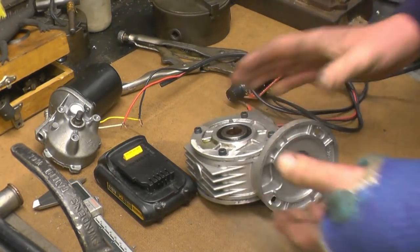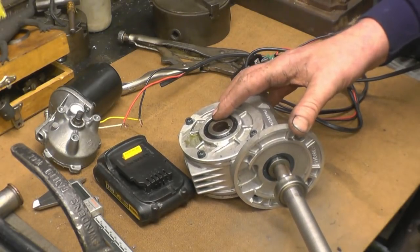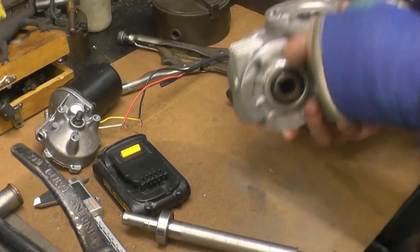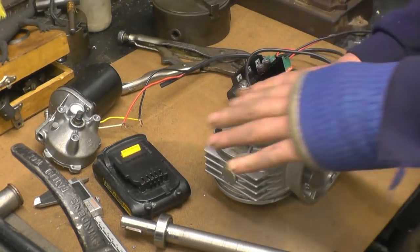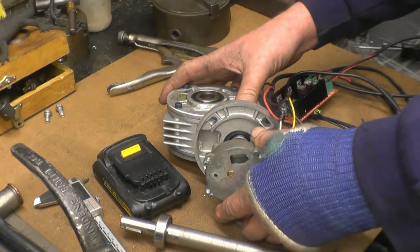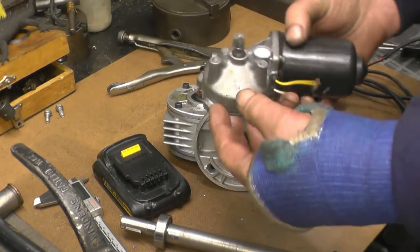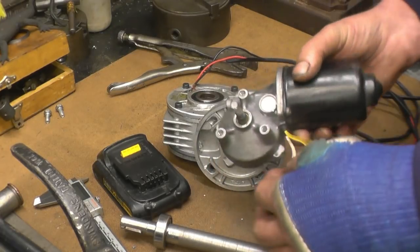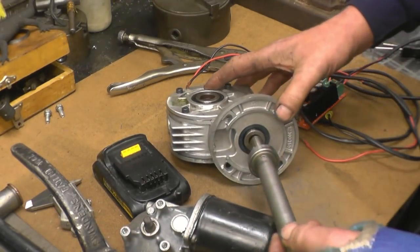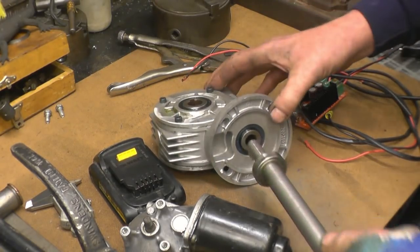The other thing I've got — I actually got this off Bob — it's a right angle drive, a reduction drive. The shaft goes into there and I think it was a 10 to 1 reduction. So I'll be able to mount this into a case somehow, face plate and chuck on there, and then drive it. I'll adapt that plate and drive it off the end of the 12 volt wiper motor. I just need to take this apart and see if I can machine a shoulder or make a new shaft, just to convert it to that size with a key on it. So it's a nice little project.